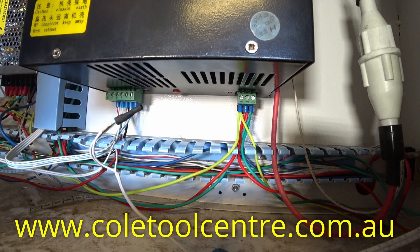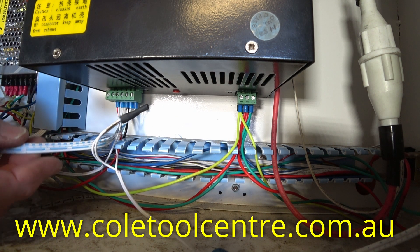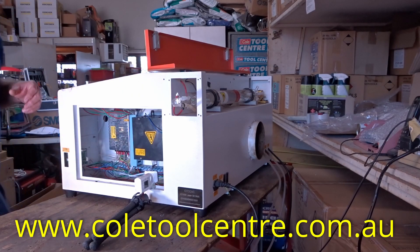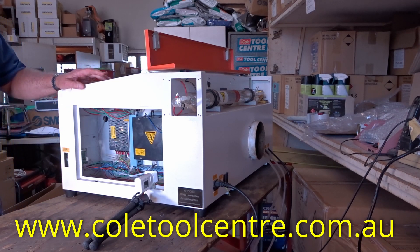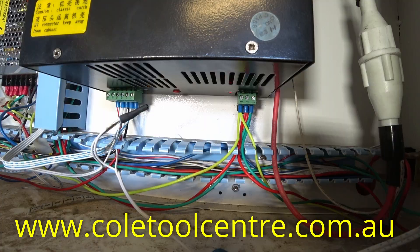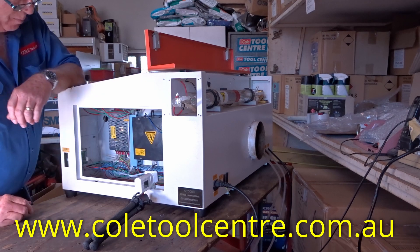So we are looking at switches which control the lid, the flow, or something like that — chasing the wiring on this side. If the lid's down and all the switches are working, then when I push my test button on the control panel, we have power. That's basically indicating that we have power coming all the way through the system and that part is okay.